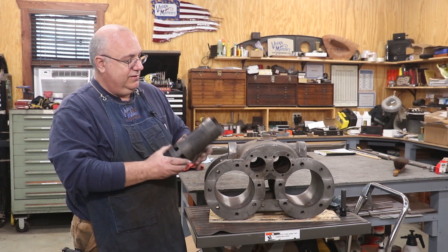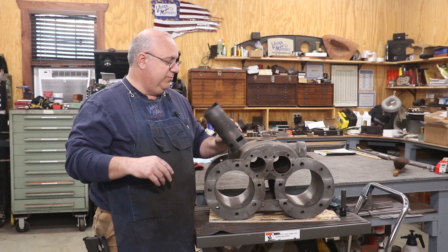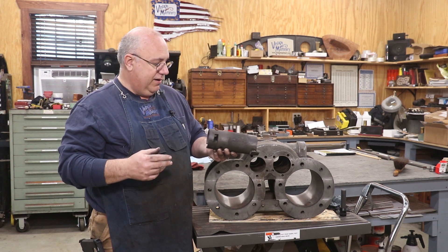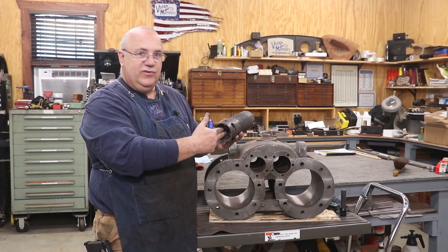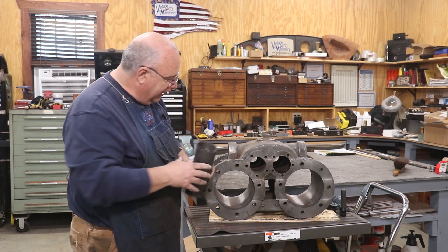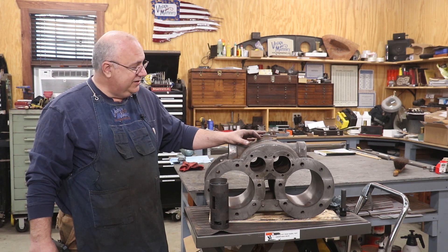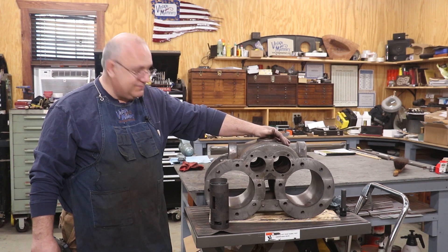I really wanted to get the sleeves out so I have something to go off of to make the new ones. The reason for replacing them: the valve seats where the valve rides back and forth are severely pitted and really pitted beyond repair. By the time I bore it out to get it cleaned up, I'll be way oversized on the specs — the tolerance on that surface is much tighter than the cylinder bores. So I really just don't have an option other than to replace them. That's going to be a wrap on this video. As always, thanks for watching, comments are appreciated — and catch us on the next one. We'll finish getting this job done and continue working on the Stoker engine, constantly making progress toward getting it where we can start reassembling this thing.